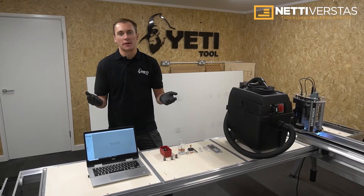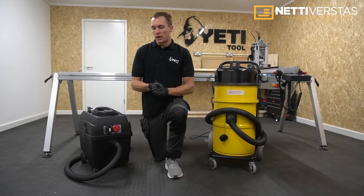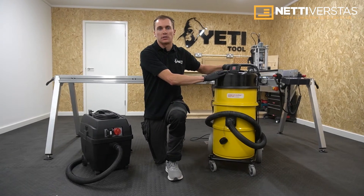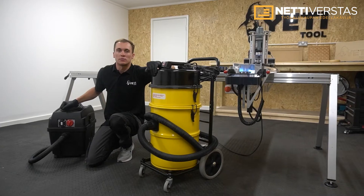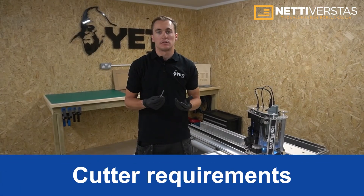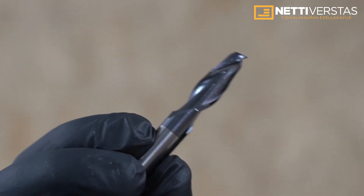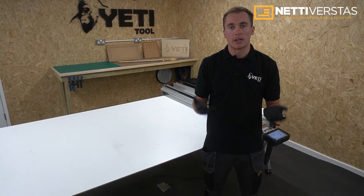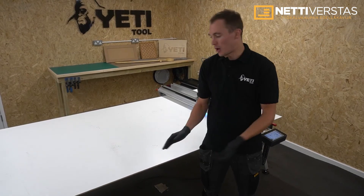It is very important to have a good extractor with good chip and dust extraction. You'll need a minimum flow rate of around 70 litres per second, but you may need a more powerful extractor depending on your material and application. If your extractor meets power specifications, SmartBench can start and stop it automatically; higher power extractors will need an external power source. Cutters come in a wide range of shapes and sizes, and having discipline around replacing cutters is very important. A good spoilboard needs to be rigid and flat — we recommend something like 9mm double melamine faced MDF.